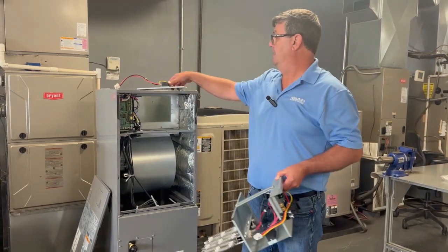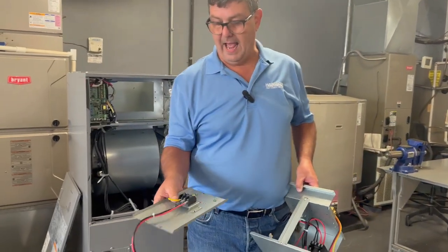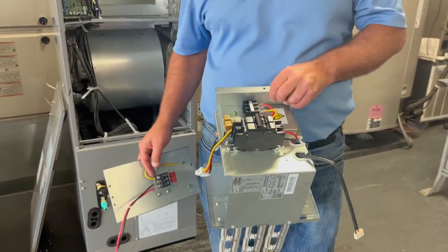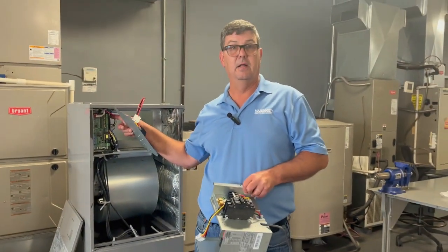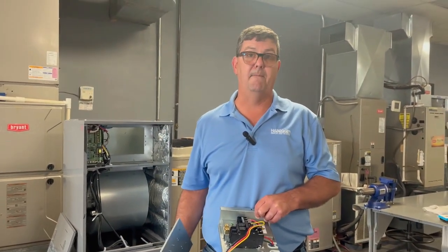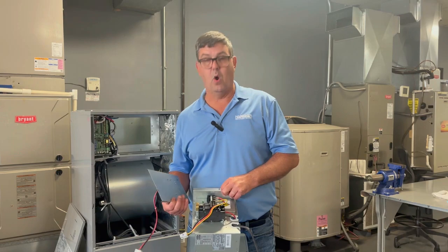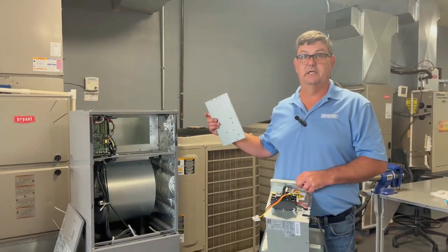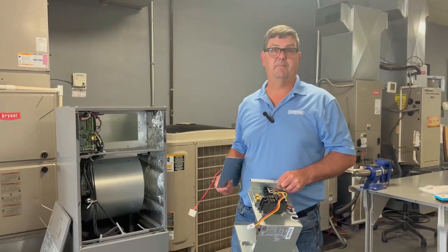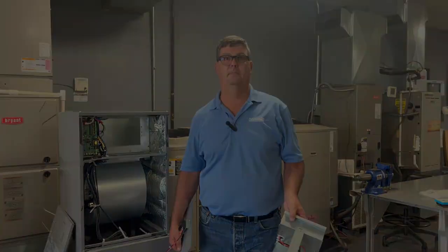The biggest concern has been this plug on the 40 MUAA — what happened to the yellow wire? It's okay, leave it in place. There's nothing connected to it up here when we plug it in, but you do need it if we're installing this in the 40 MBAB. I hope this clears up the wiring for the electric heater on the ducted ductless systems. Thank you — like and subscribe to Haberger Help, and we'll catch you later.